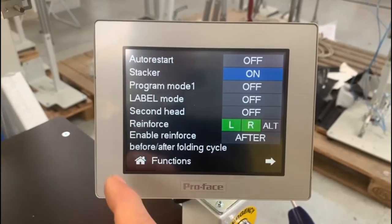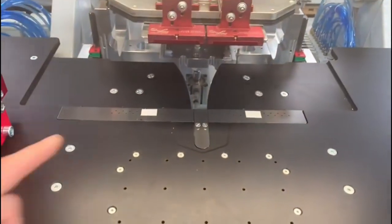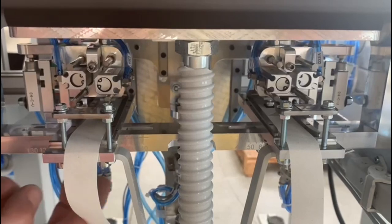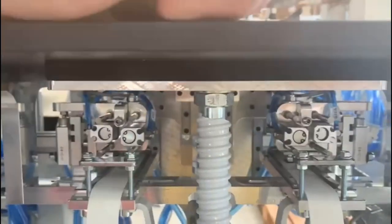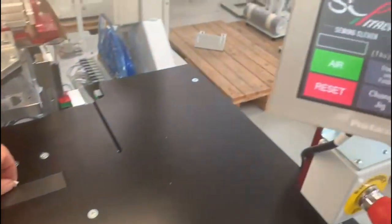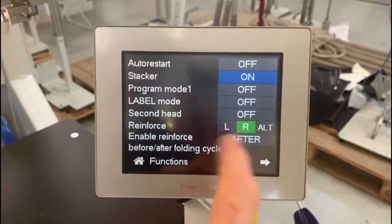That's why we can assure you that you achieve an amazing productivity. The intermediate position gives a closer distance and a shorter movement of the loader, which means a faster sewing start. For comparison, in the R version the loader has 15 cm less distance than the standard pocket setter unit. If we compare with a Chinese machine, we have 60 cm less distance — at least 2 seconds difference in time for each pocket loading.